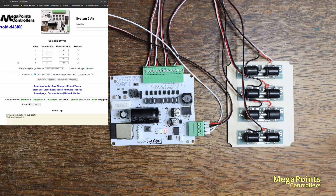If we take a look at the user interface for the solenoid driver you can see there are four motor outputs and they can be attached to whatever v-port you want. We have the feedback v-ports here so each can report its own status, and then we have the ability to reverse the output as well. It's showing the charge voltage here which is usually around 20 volts — that shows the live state of the charge and it will keep that topped up continuously whilst it's powered.